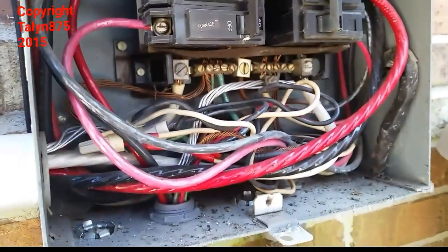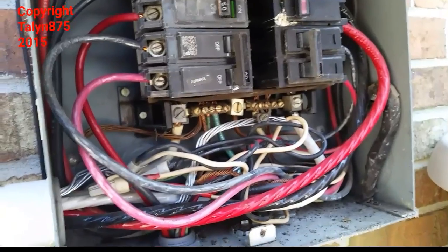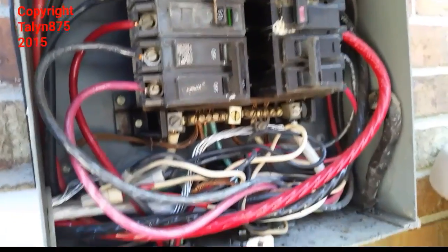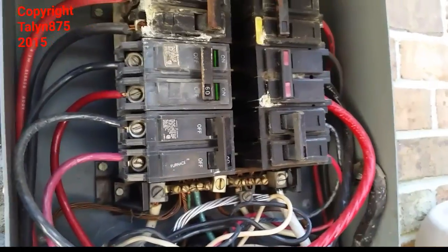We're shutting the unit off at the breaker panel. As you can see, there were a lot of breakers and a couple were labeled 'heat' — but that's another unit at the other end of the house, making it difficult to tell which is which. Sometimes you have to take the breaker panel off and look inside to know which breakers are shut off for your unit in order to be safe.